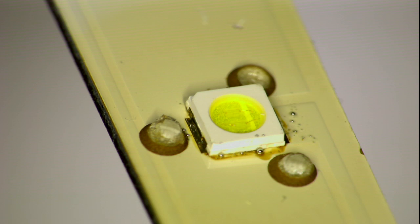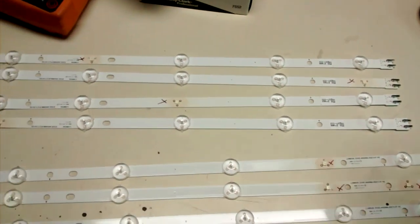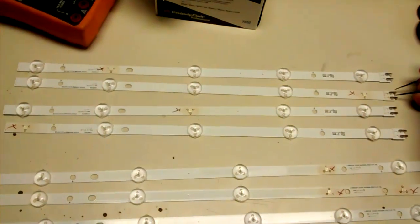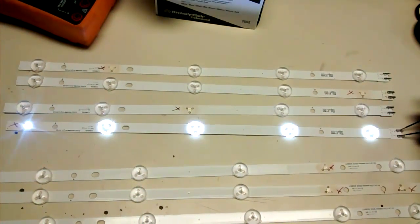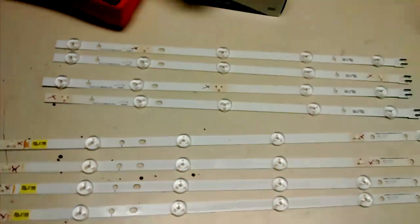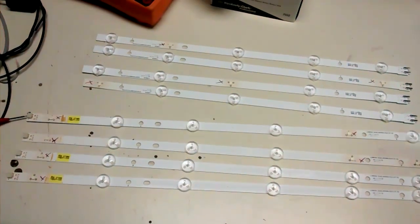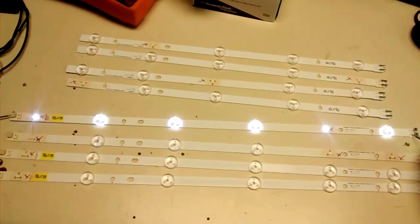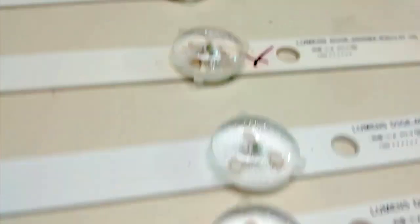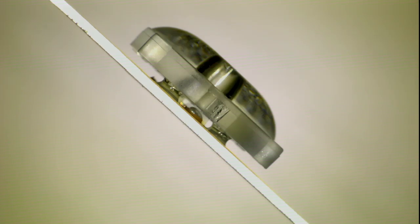This is how it should look like — the LED flat on the PCB. Now once all are done we test the LED strip: about 13.6 volts for the smaller one with 5 LEDs, and about 16 volts for the larger LED strip which has 6 LEDs. So now we are sure that everything is working. We glue the little plastic lens back on the LED. This was the original one, and this was the one glued back on the LED.